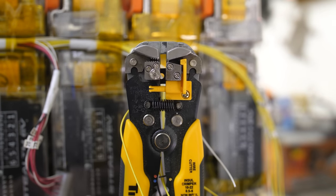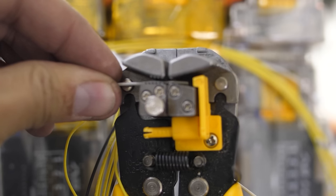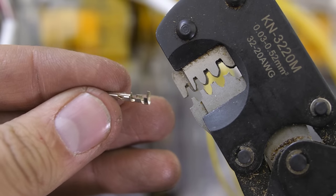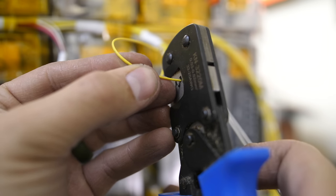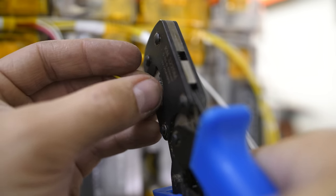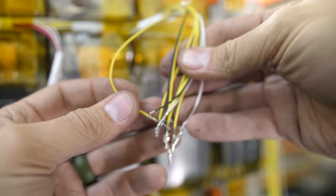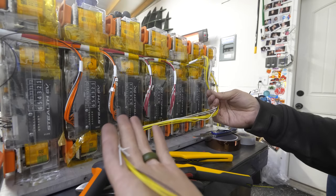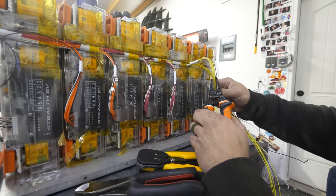Stripping the wires is easy with this little magic tool that exposes about one eighth inch of wire. Then we crimp the wires using an alligator crimping tool and a metal pin that fits down inside the plug. I slide the wire through the back of the pin and crimp it down. There are two pinching points — one on the insulation and one on the wire strands for a secure connection. For the thermistors, every five wires shares one ground that we daisy chain from wire to wire, chaining all the grounds together to keep the connection.